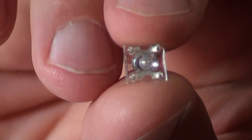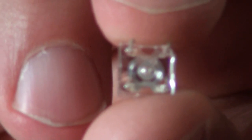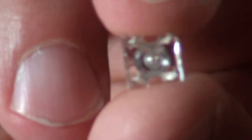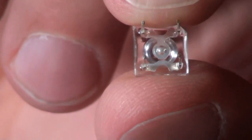The big problem is all four prongs are the same length, so you have to know which is positive and which is negative by looking at the underside. What you're looking for: the two prongs on the bottom are connected, and the two prongs on the top loop around the bottom of the loop — so the top is negative and the bottom is positive. I had it oriented properly: positives on the bottom, negatives on the top.